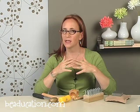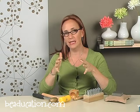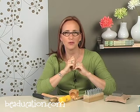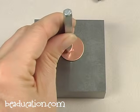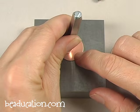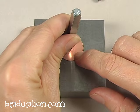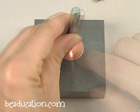And I want to remind you, I know I sound like a broken record, but make sure you practice your design stamps each time before you use them. Now, if you're stamping away with letters or sometimes design stamps and you only catch one side of it, you can go in and reline up your stamp and try to do it again, but it's a little tricky. So if you miss stamp and you only catch one side like I've done here, you can go in and line it up, maybe close your eyes, feel the stamp fall back into the groove, and give it another whack.